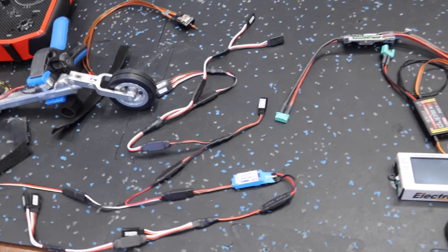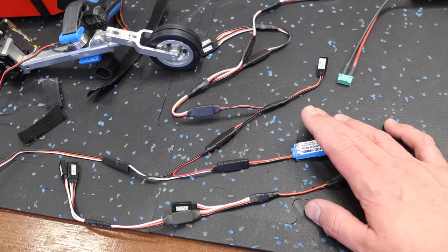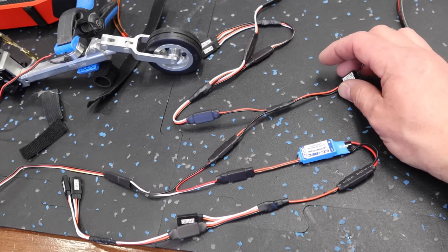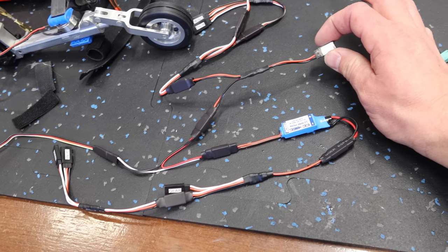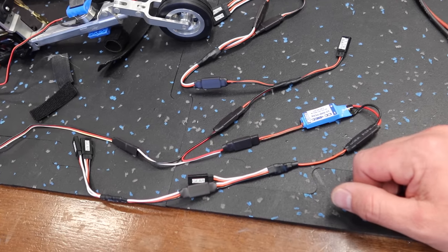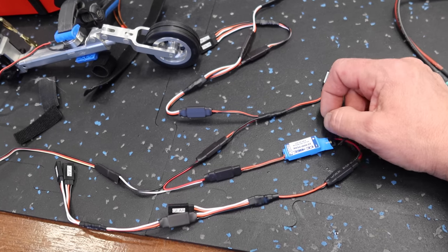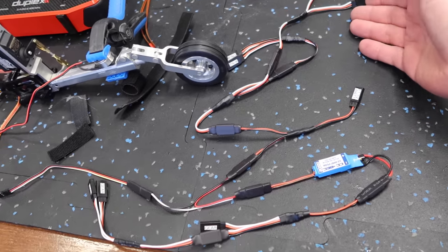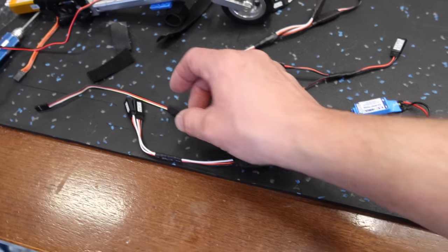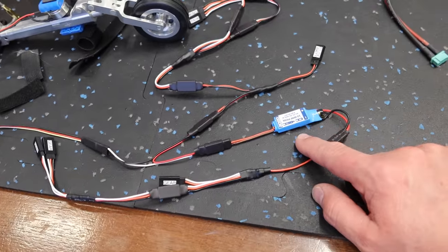So one consideration to keep in mind is with our lighting harness. Now our afterburner lights need a 2-cell LiPo or 8.4 volts. So I think what we're gonna do is tie it into the existing system because we do have that option available. Our lighting battery plugs in here and this feeds both sections of the wiring harness. There's a switch on our battery lead coming to the harness. When we turn that switch on, all of our normal light system is gonna turn on. And this side here feeds the gear system. So that's the control for the gear system right here.